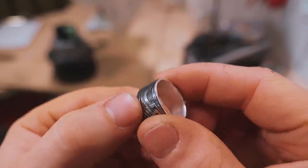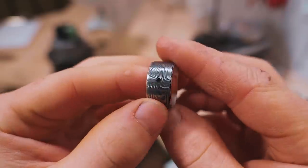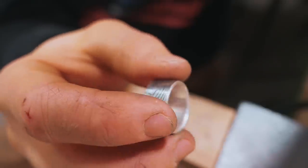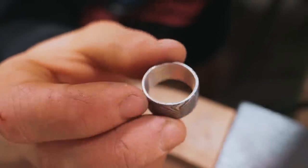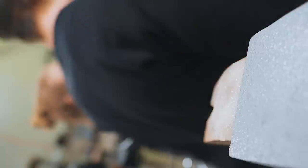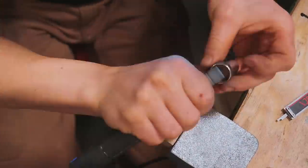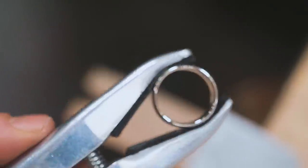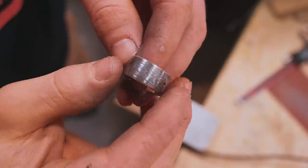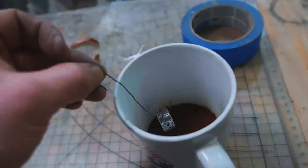I've started burnishing the edges of the silver to get them to blend onto the steel nicely — it's starting to look pretty nice, but still needs a little more touch up, so I'll move to sandpaper for these edges. With the edges looking a little better, I'm now working on the inside of the ring. I just took a little cotton mop to it to polish it — it's insane how shiny that is, possibly the shiniest thing I've ever made. But working with abrasives will wear away some of that contrast from the coffee etch, so I'm going to re-coffee etch it.